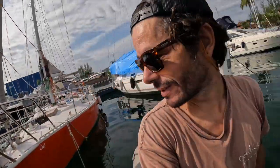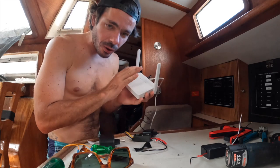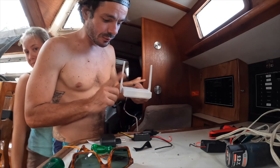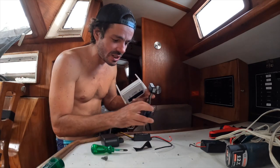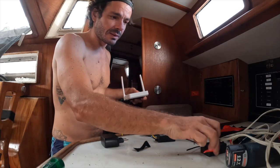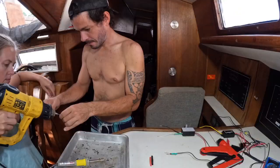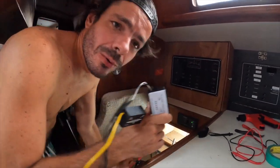But now I have no key for the outboard. The next step is to convert all our internet to 12 volts. Right now the wifi is 5 volts and the 4G antenna we use is 24 volts. With one small converter box for the wifi and another for the 4G antenna — one converts 5 volts to 12, the other converts 24 to 12. To do that we need to cut the wires, so right now we have no internet. Ready to be installed.